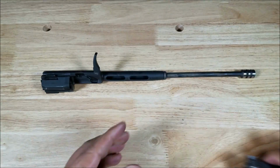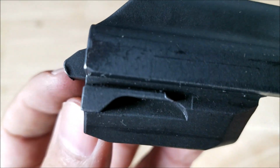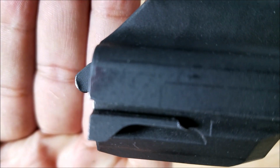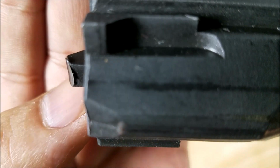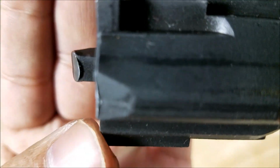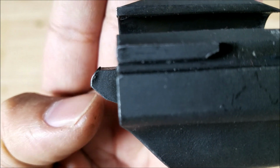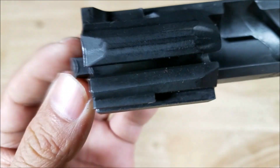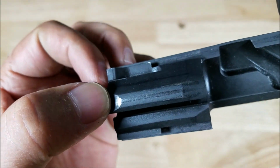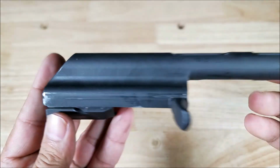Now on to the S7 portion, S7 steel. Let's have a look at this dovetail area. Everybody's going to be curious about that, and we can see a little bit of mushrooming right there. You can see the shadow forming right there. Let me flip this over just a little bit. You can see it, little lip forming there, got pounded down just a tad. Going to rotate that around to the other side, and you can see it there as well. So just a little bit of deformation, as the Vska says, right in that area. But the rest of it, you can see a little bit here. That's nothing as well. Just a little bit of wear happening on that S7 steel. So it's hanging in there.